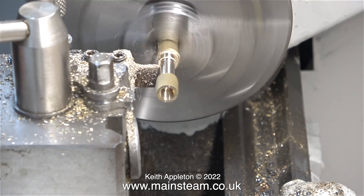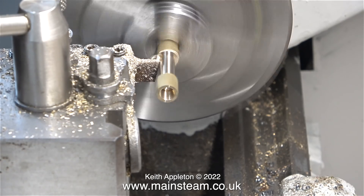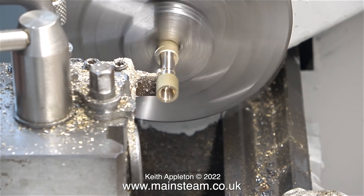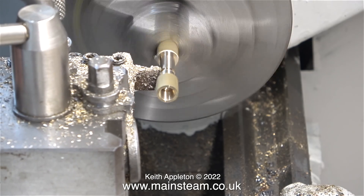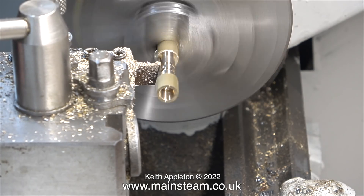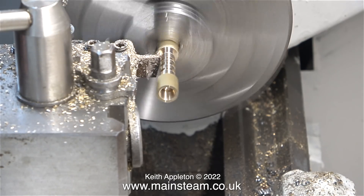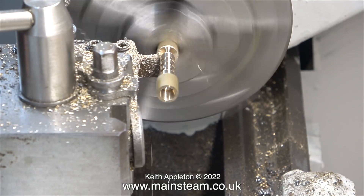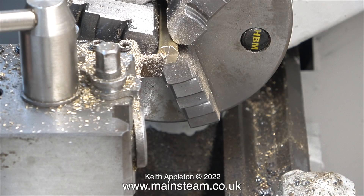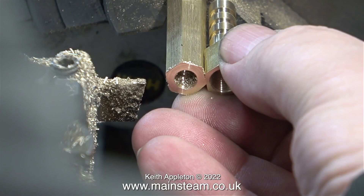You may be thinking that these grooves are going to be part of an air seal system to make sure that the silicone rubber tube is a good fit on the piece of bar. But in reality they're not necessary at all, because if you push a piece of silicone rubber tubing onto quite a long brass tube it doesn't really want to come off - though it will come off if you turn the air pressure up too high. By grooving it, you just reduce the surface area in contact with the inside of the silicone rubber tube. However, if you use a small cable tie or a piece of twisted wire to press the silicone rubber tubing into one of the grooves, the piece of tubing will be very securely attached to the fitting.